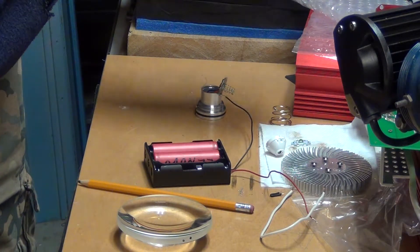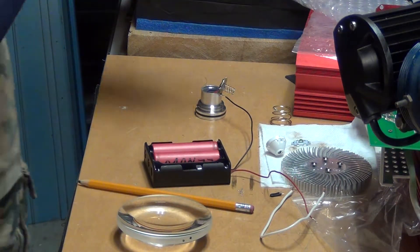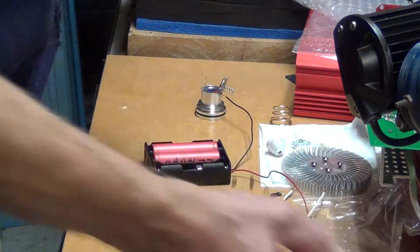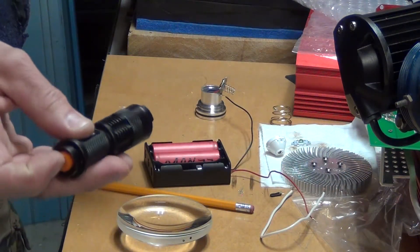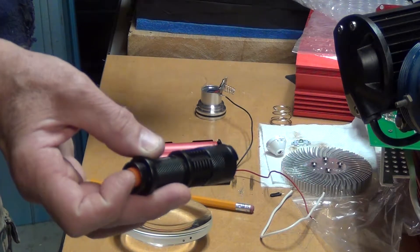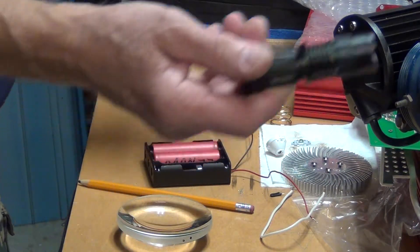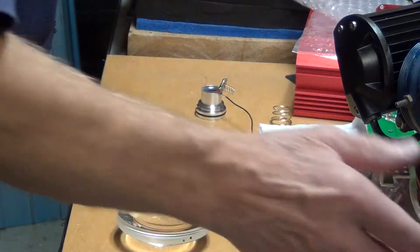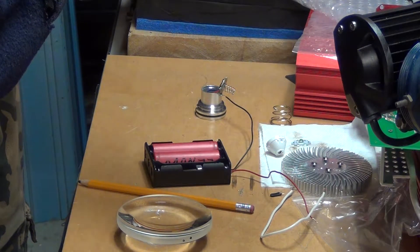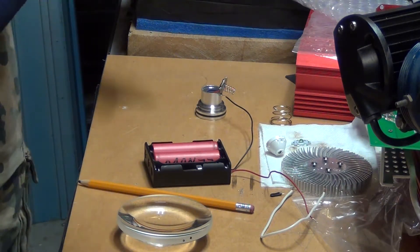I was really starting to throw these flashlights in the trash, but then I discovered that some of these flashlights, when you let them sit for a while — let's say you end up in middle or low mode — they will go back to high mode. There's some kind of discharge of a capacitor that takes care of this problem. Some of them have a resistor over the capacitor so they will go back into high mode, but most of the cheap ones don't.